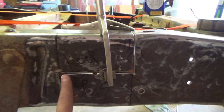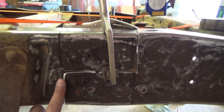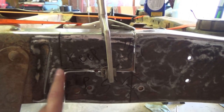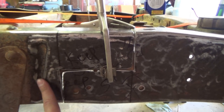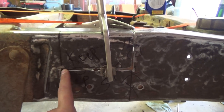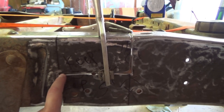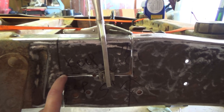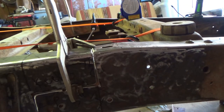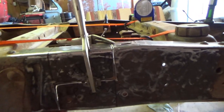The corners were fitting a little too tight, so I ground them down a little, rounded them off, and then I also cut a little bit out. I took too much, as you can see. I should have just rounded this off and pretty much left that alone, but oh well. I'm gonna wait to weld those corners until I have the fish plate in behind here, that way it'll weld kind of onto that plate, hopefully, and make it even stronger. See, yeah, I planned it that way.